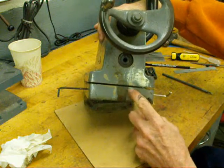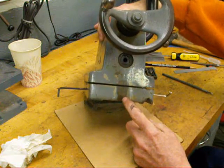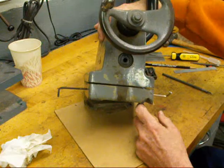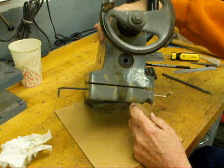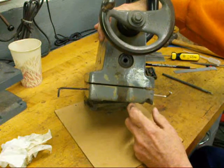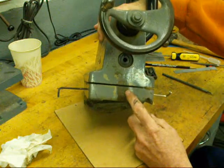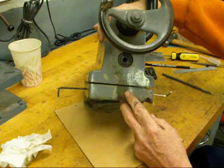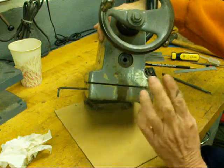But why would this be off? Well, it could be off for several reasons. First of all, one of the methods of cutting a taper on a lathe is the offset tailstock method, where we move the two halves apart a certain amount, and if you're turning between centers you'll get a taper. You don't want this to be off-center for any other reason, because you're going to cut a taper automatically and you don't want that. Also, when you're drilling and reaming, you will be plowing — that is, not coming in on true center — resulting in broken drills, oversized holes, and other inaccuracies.